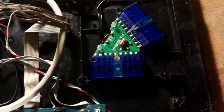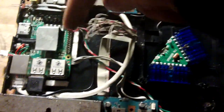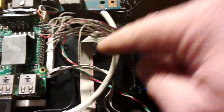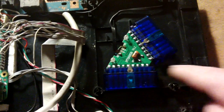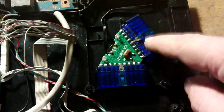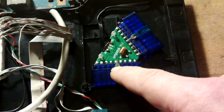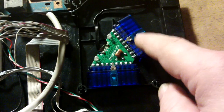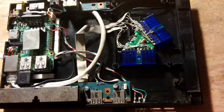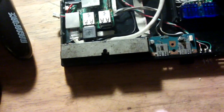Here's the adapter now sat in place. I'm going to run the wire properly — I've got it going around and down to the USB port, so I'm going to tidy that up a little bit. The next part is to solder all these onto individual connections along the sides. I tried it earlier and found out this is player one — on this right hand side. There we go, all 18 wires, and this thing is now in place. Plug in a controller at the front and it should work.